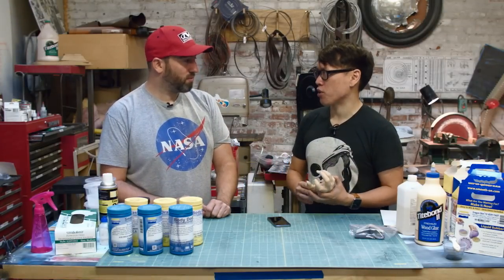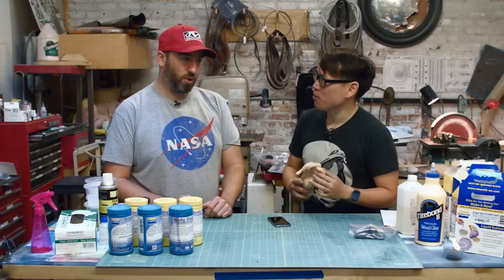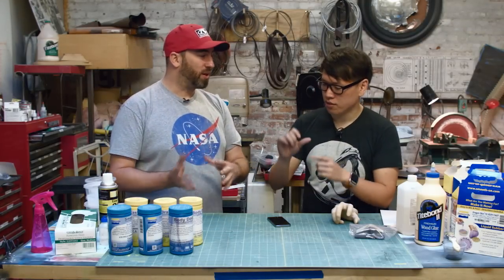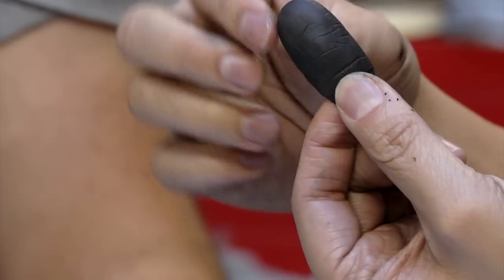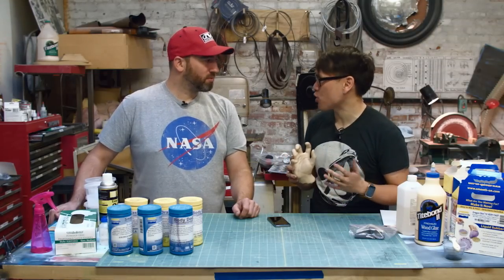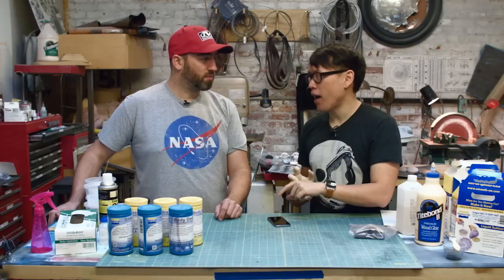So we're talking about mold materials and casting materials. When using silicone as a mold material and doing it right, you're going to get a more accurate casting — almost exactly one-to-one, microns of accuracy. The casting material is also important. The pad at your fingertip is about 35A durometer. The durometer scale measures how soft or rigid something is — there's an A scale for soft things and a D scale for rigid things. Your thumb tip is about 35A. But the problem is when you push on the button, it doesn't have enough give to flatten out. So we want to go softer. This casting is done in a 20 durometer silicone, and we want to go even softer than that.